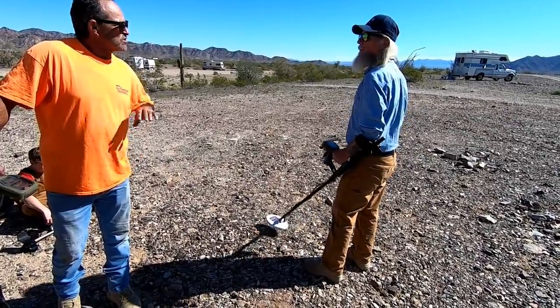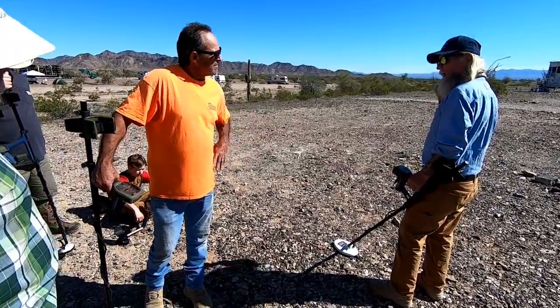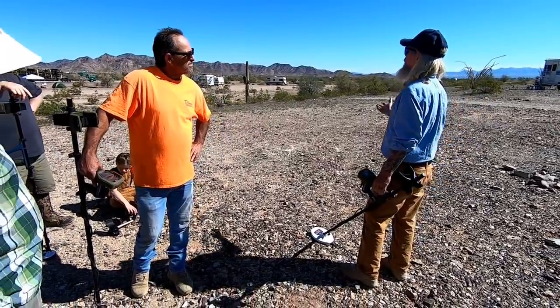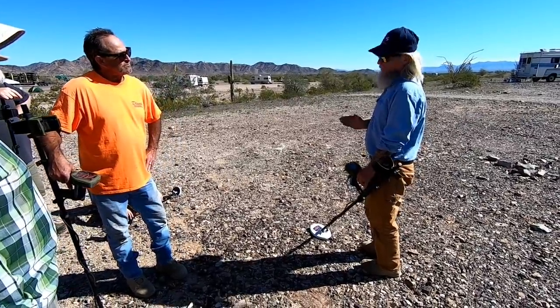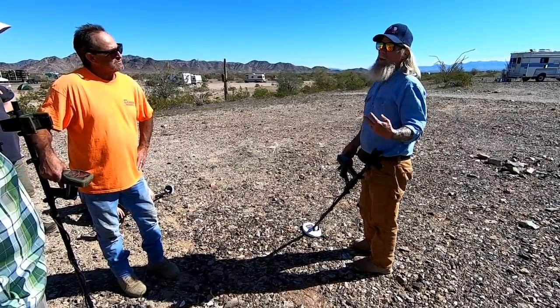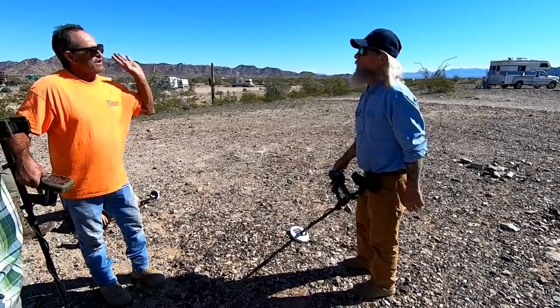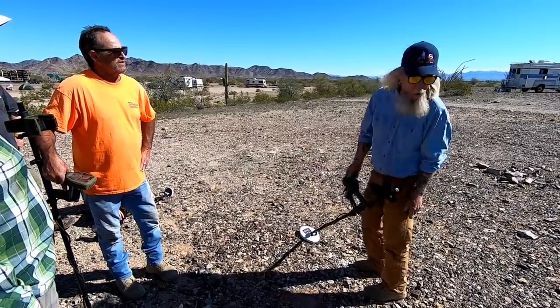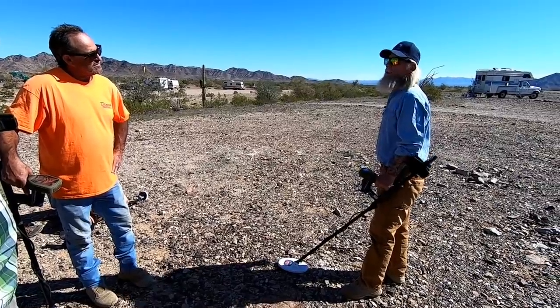Quiet as a mouse. So just from jumping over the 2 back to the 1? Yep, that's what I recommend, in areas like this where most of your hunting is auto 1, because it'll balance, and the machine, when it's in auto, is helping you track. A lot of people get in trouble. They've got a machine with automatic ground tracking, they think they balance at one time and go hunt. Wrong. Constantly.